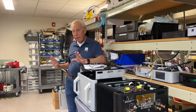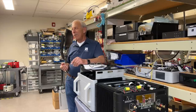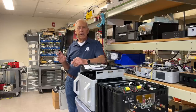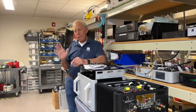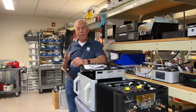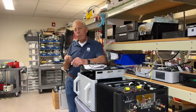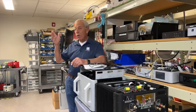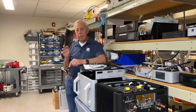You add your preamp back in with no sources connected to it — nothing. This is really important. All the time people say they followed those instructions to the letter — really? Did you disconnect the sources? 'Well, no, because it can't be the source.' Stop. Don't even talk to me. Take it off. Follow the instructions to the letter. So: the preamp alone, hooked up to the power amp — is there hum? If there is no hum, one by one you add your sources and you follow that process. At some point the hum will appear because it comes when your system's together. We just do it piece by piece and narrow it down to the piece that is causing the hum.